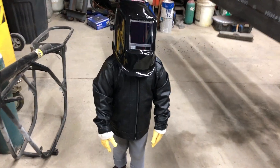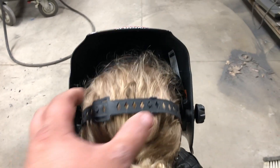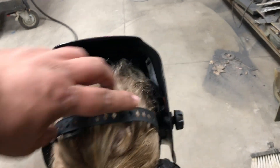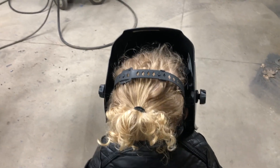Make sure there's no open exposed skin around the neckline, on the arms, or on the legs. Your hair should be in a ponytail. Ideally you want to wear a cotton welding cap, and the headgear has to be adjusted properly — this one here needs a little more adjustment, but the rest is pretty solid.